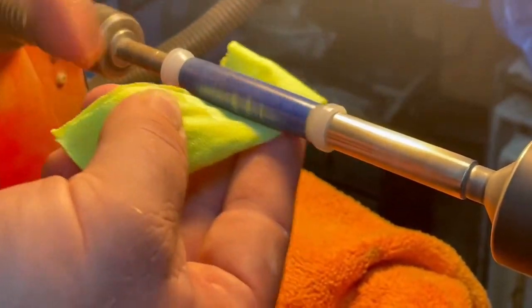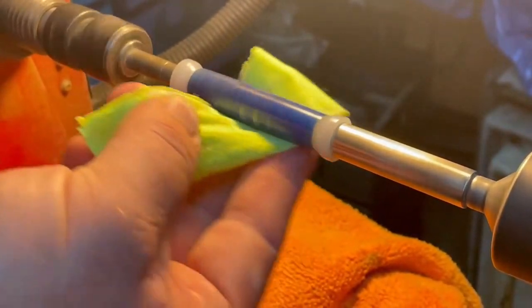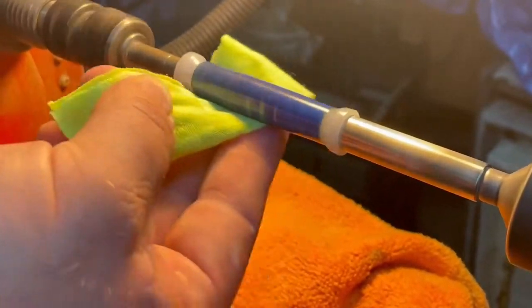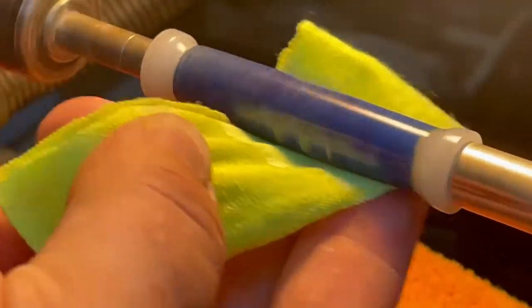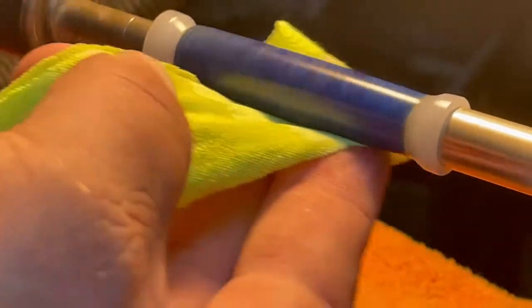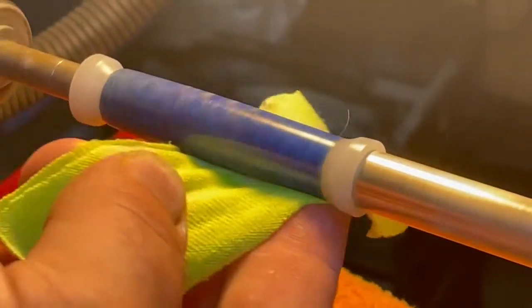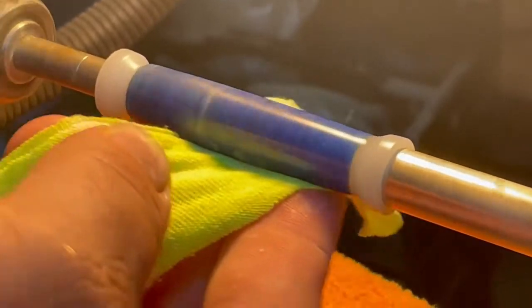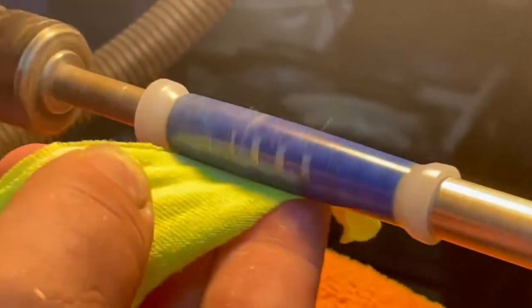And as you can see, when I first started, there was some little white rings going around it, so you could see each time it made its evolution. Then I just kind of move my hands a little faster and I kind of polish it as it's going. I can feel the temperature increasing a little bit on my fingers. It's not hot, but you can actually tell there's some friction generating there, which is what you're wanting. You're basically wanting to use this as a friction polish. And I'll just move and make sure we get the rest of that off that cloth. That'll finish taking any of the scratch marks that possibly could have been on there from the micro mesh. It will take those out.